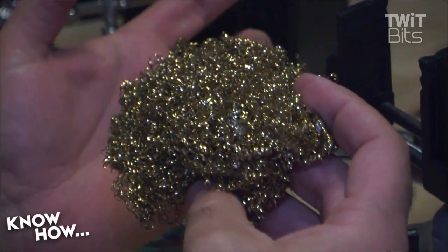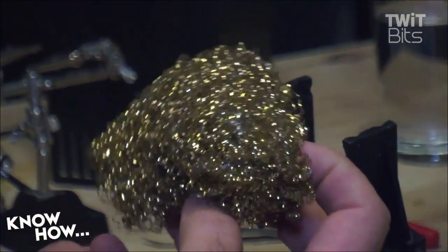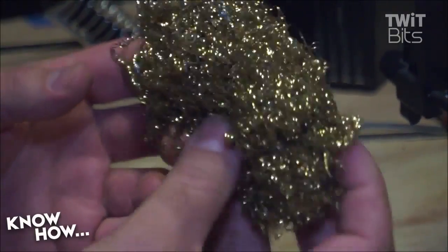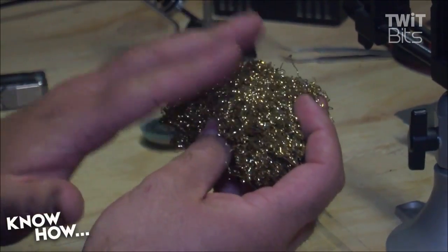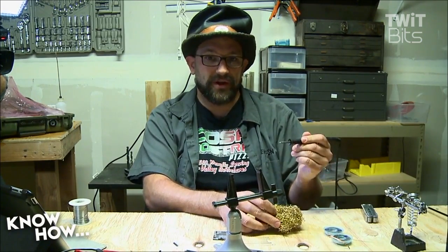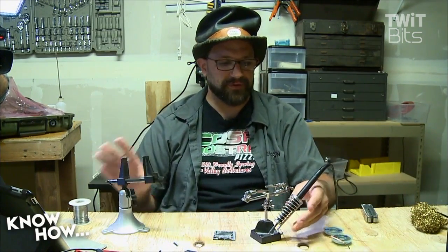You're also going to need something to clean your soldering iron. You can use a wet sponge or a wet piece of paper towel in a pinch. I prefer these metal Brillo pad-looking things - you can get them anywhere you buy a soldering iron. This one has seen a lot of love. They pretty much don't wear out, they just get flatter. The advantage over wet ones is that these don't make your soldering tip cold. The whole thing about the soldering iron is it needs to be hot, so if you clean it on a wet sponge that's going to cool down your tip. These won't do that - that's why I like them.